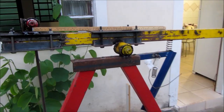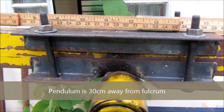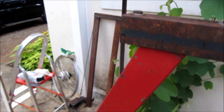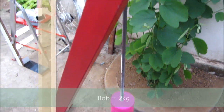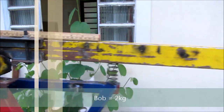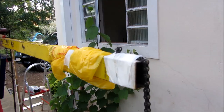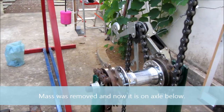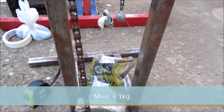Hi, we are here on the two-way oscillator to give a look at a new experiment. Here we have our pendulum at 30 centimeters away from the fulcrum for the bob. The mass of the bob is still two kilos, as in our earlier experiments. The spring is the same — all the things are the same — but here at the end we have the chain, which is attached to the ratchet, which goes through the axle and winds up this little nylon string to bring this one kilo mass up.